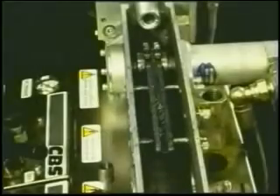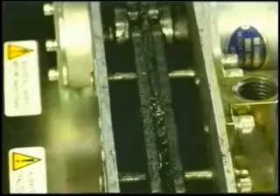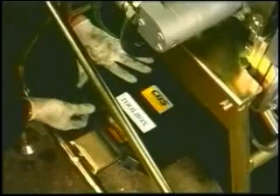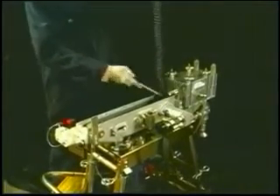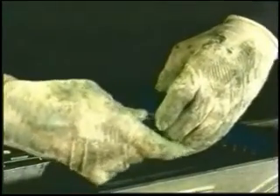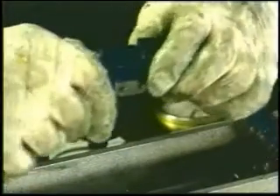To replace the chain, first check the condition of the chain slide bars and also the free rotation of the sprocket. Feed the chain into the unit. Reassemble the chain connecting link and refix the split horseshoe clip.